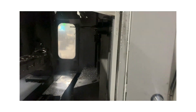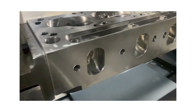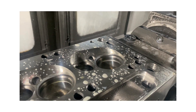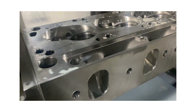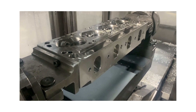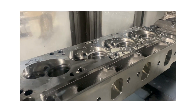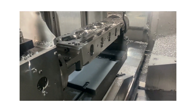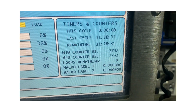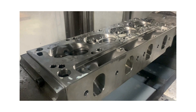Overnight we've been porting, which is what we do every night. Here we've got a CNC ported 2V head that'll come out, get pressure tested and inspected. If it's all good, that'll get the bowls blended and seats cut, and a final pressure test — then it's right to go. These machines run production all day and CNC port at night. The beauty of it is we're using the same fixture used to manufacture the cylinder head, so we keep a lot of accuracy using five-axis machines the whole way. That program took 11 hours and 28 minutes — typical for us to CNC port a head, which is just inlet and exhaust ports, three passes.